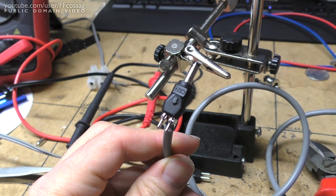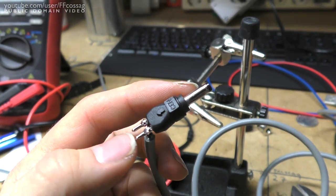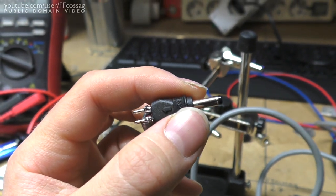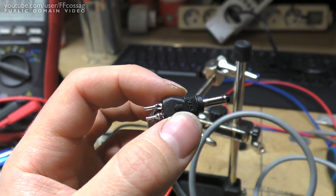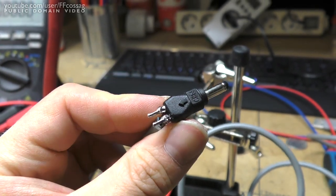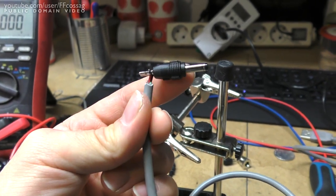Moving on, I'm making a charge adapter for this particular camera. This is how I normally make them - this is a plug from one of those universal plug packs. We've got millions of these left over at work, so I just solder some of these on, cut them, add some hot glue, and you have a nice 90-degree connector which fits perfectly.